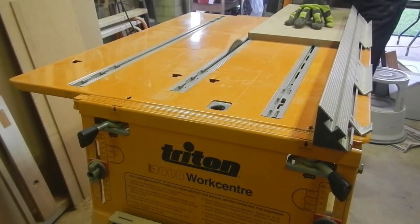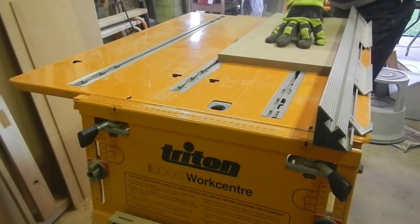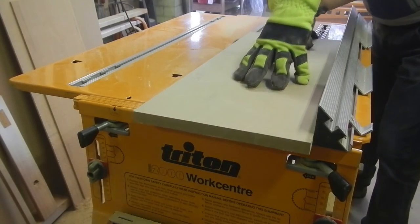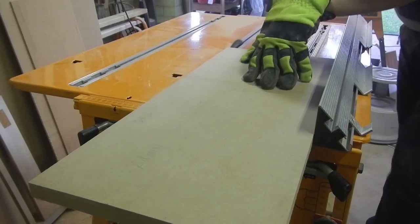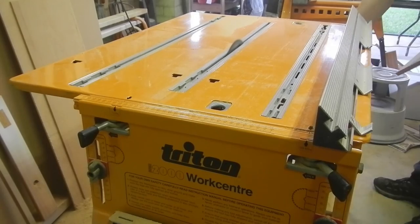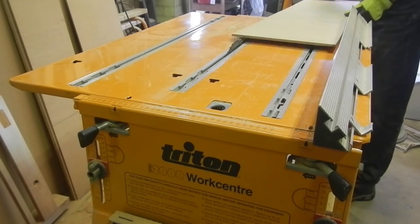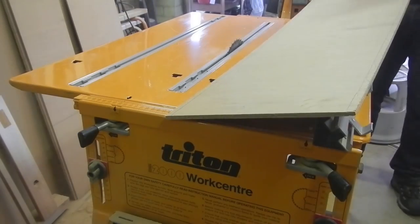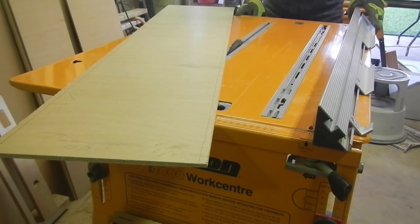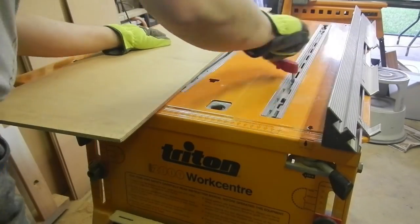So this is cutting up the shelves for the vertical shelves going up the side of the unit, of the cabinet. These ones have to be 250 millimetres deep, and 302 wide, I believe. That's so that the folders can fit with the spines facing out.